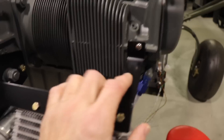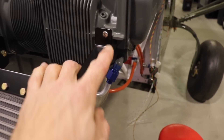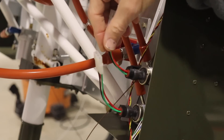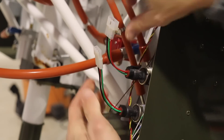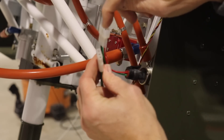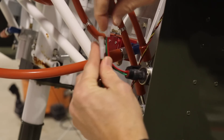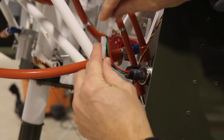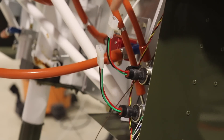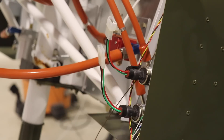This is all done except for one screw that's just a placeholder. I have my oil pressure and fuel pressure senders mounted right here. I put a female connector on one and a male connector on the other so that when the wires coming from the Dynon EMS connect, you can't hook it up backwards — it'll only go one way. Same approach I used with my nav/strobe lights and leading-edge recognition lights in the wings.